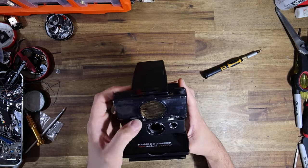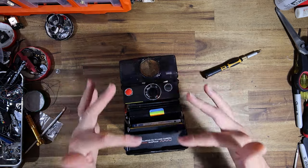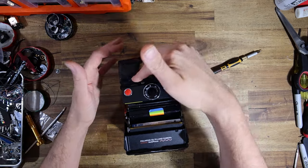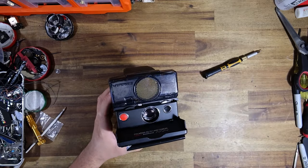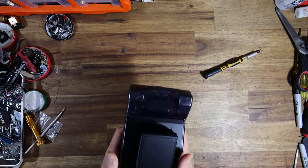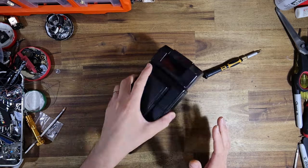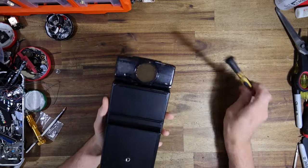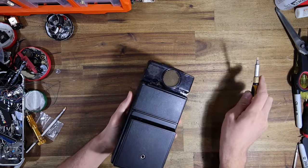So again, to reset it, I like to just put the lens all the way forwards, and it doesn't matter what order you do the door or the autofocus switch, what should happen is the lens should go all the way back home. Hopefully that sorts out your issues. As I said, if the camera doesn't behave like that, then odds are overwhelmingly positive that your Optosensor needs fixing.